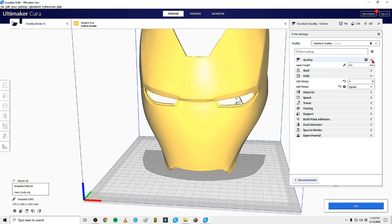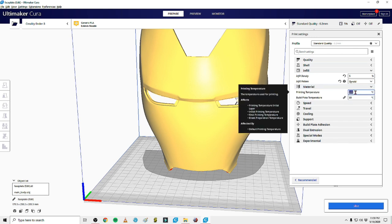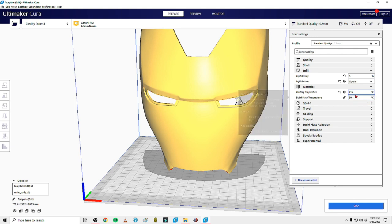For material settings, this is just getting familiar with your filament. The Monoprice and Sunlu PLAs I print with - usually black or gray - really like about 215°C. It sticks well, bonds well, great layer adhesion. But this is something you have to figure out for yourself: what temperature works best for your PLA. My bed likes to be around 60°C and it sticks pretty well.